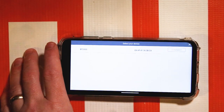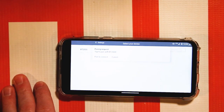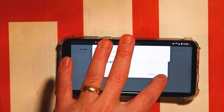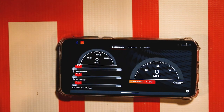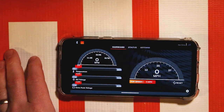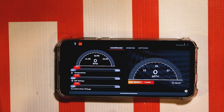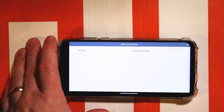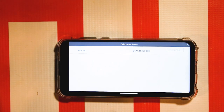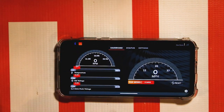Once it's blinking quickly you'll be able to tap on it and connect. Hit pair and connect — yes, we want to pair. Now it's connecting. Once you've paired it, if we turn off the radio it'll disconnect. When you're ready to use the dashboard app again, turn on the radio, the LED on the BT2000 will start blinking slowly, tap on it and you'll be able to easily reconnect without having to do the pairing again. It's essentially the same process between iOS and Android — the way things look might be slightly different.